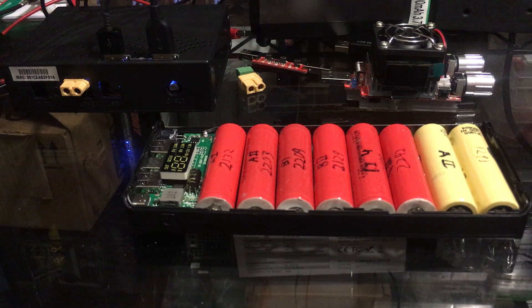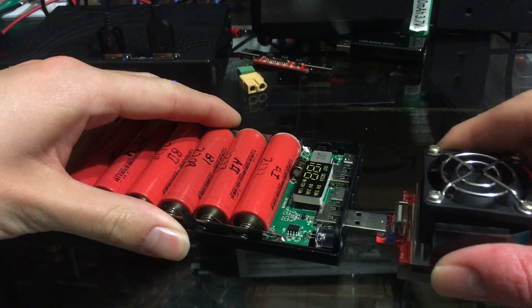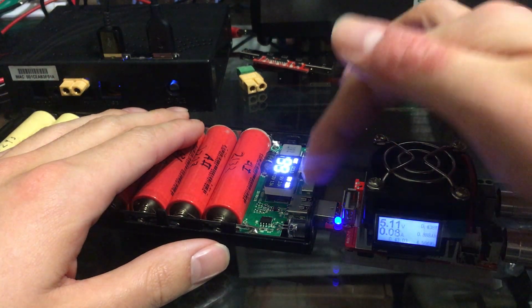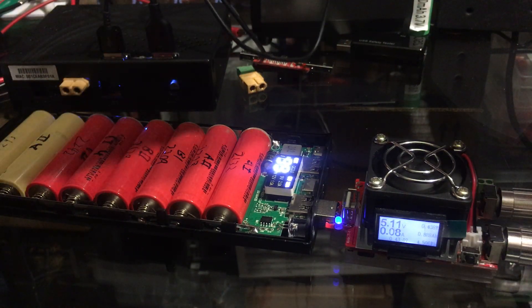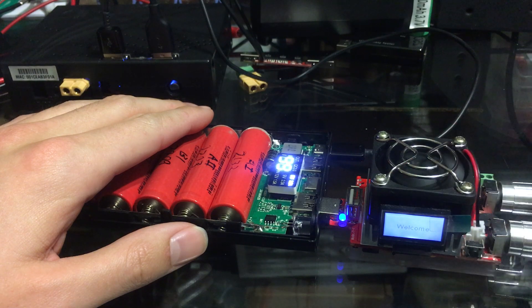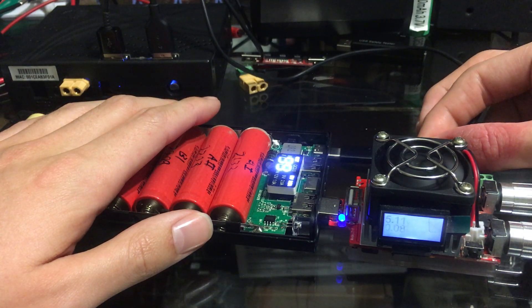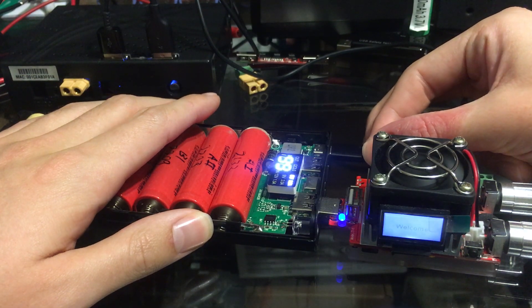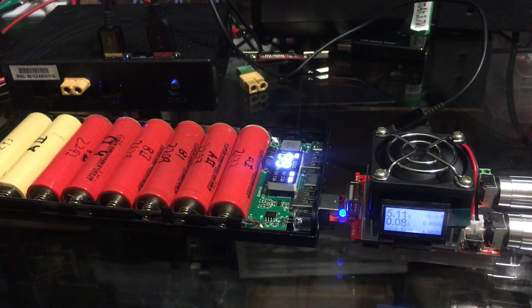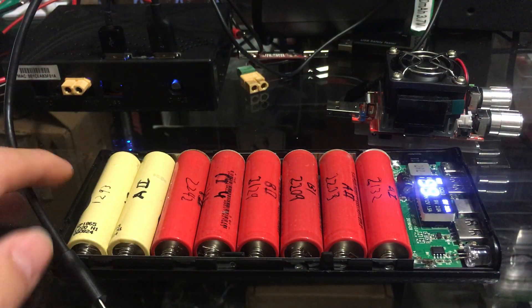I'll show its behavior when plugging in devices. Flip it around and plug my DC load in — it turns on automatically when you plug something in. Grab the Type-C from my other power bank and give it power. The output switched off for a second to initialize, then when you unplug it switches off again. It's safe I guess, but not very responsive, so you'd need some sort of secondary UPS and shouldn't pull too much power — supported but not great.